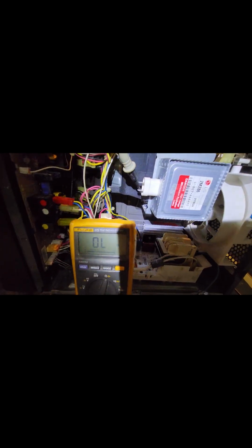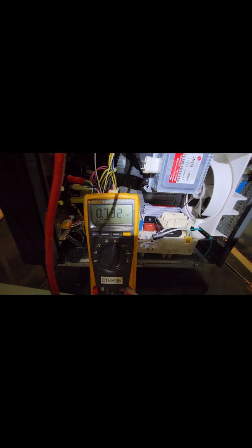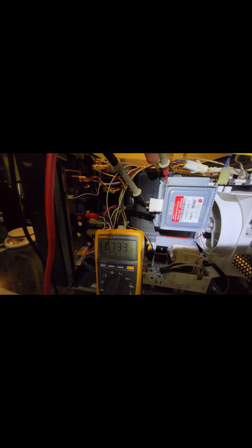Okay, so coming back to my initial diagnosis. Again, I'll show you on my multimeter in ohm mode. And as I said, this 2-port should show 0.2 ohms, but at the body it should always be open, but here you see it's less than a megaohm, which is not supposed to be.